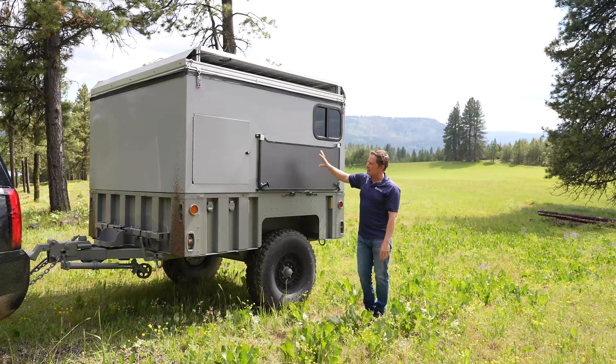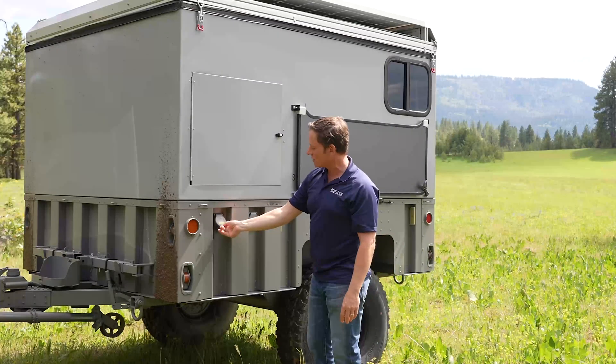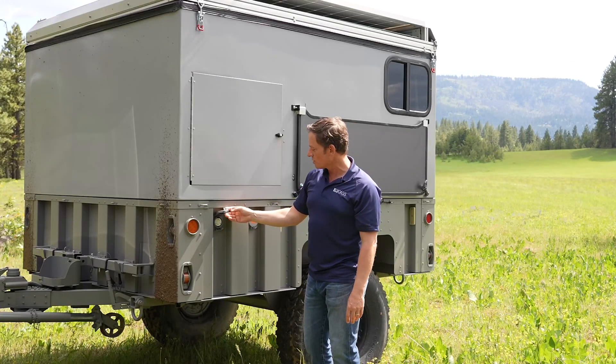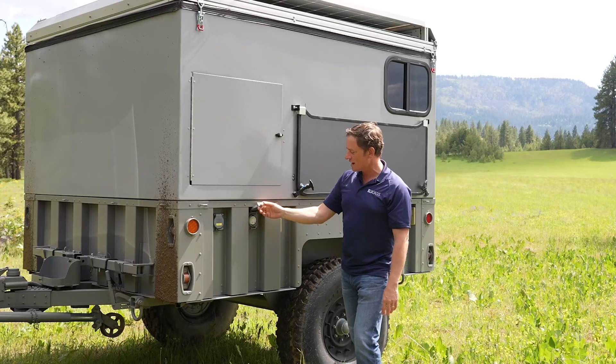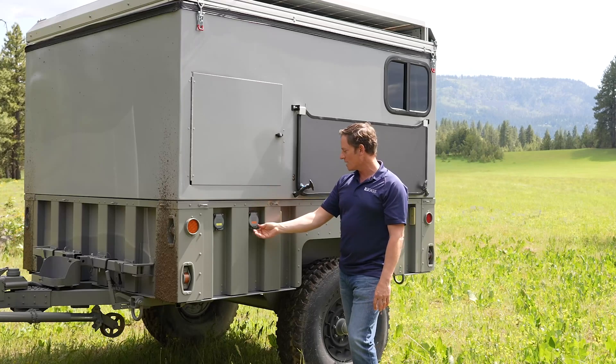The inverter serves up two outlets. We have all-weather outlets here: 120 volts, 30 amps to power your RV or support your remote work site. And then we have a 240 volt, 30 amp, 6 kilowatt output — and we can upscale that to a 12 kilowatt output.